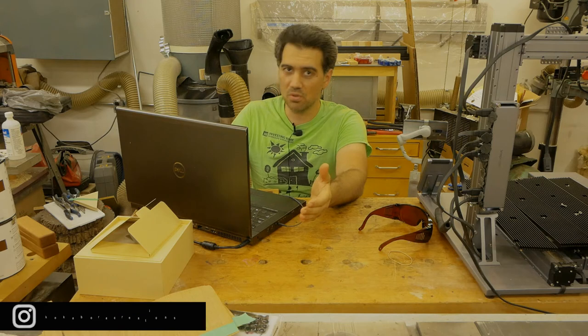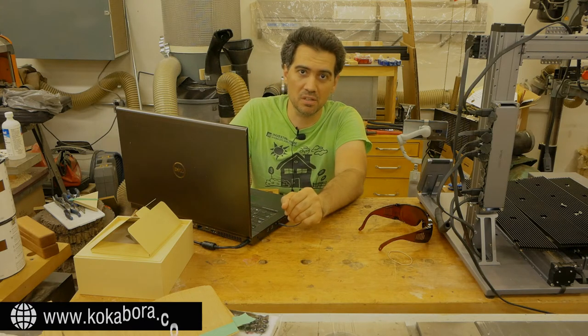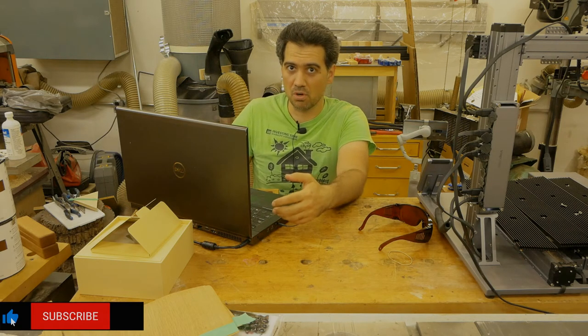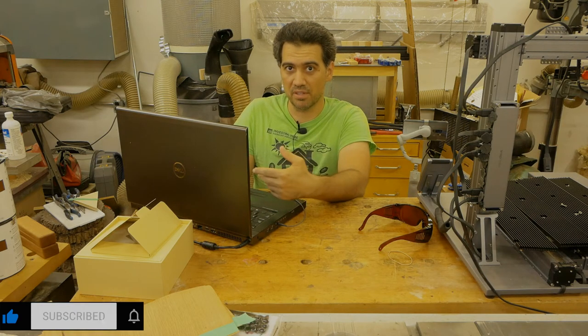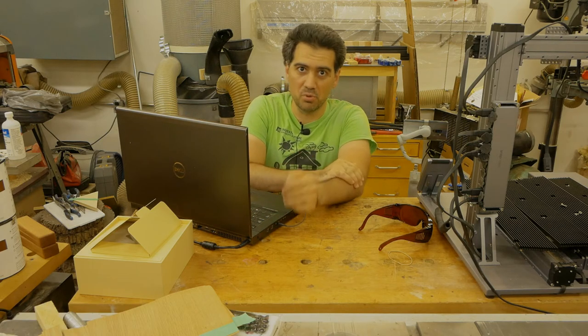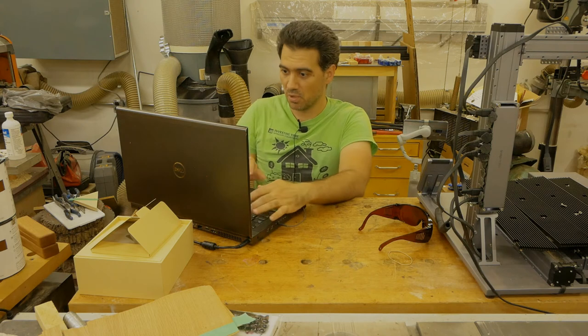So this is the way you install the Snapmaker Luban software onto a Debian system. And like I said, that's only particular to Debian. When originally I had this issue, of course, I opened up a support ticket and they mentioned that everything is working fine for Ubuntu. So I installed a virtual machine with Ubuntu and yes, everything was working fine. And then I kind of discovered that those dependencies, the libappindicator, is dropped from Debian, and I had to do that particular step of removing that dependency. So now you have a way of doing that and using it on the Debian system as well.